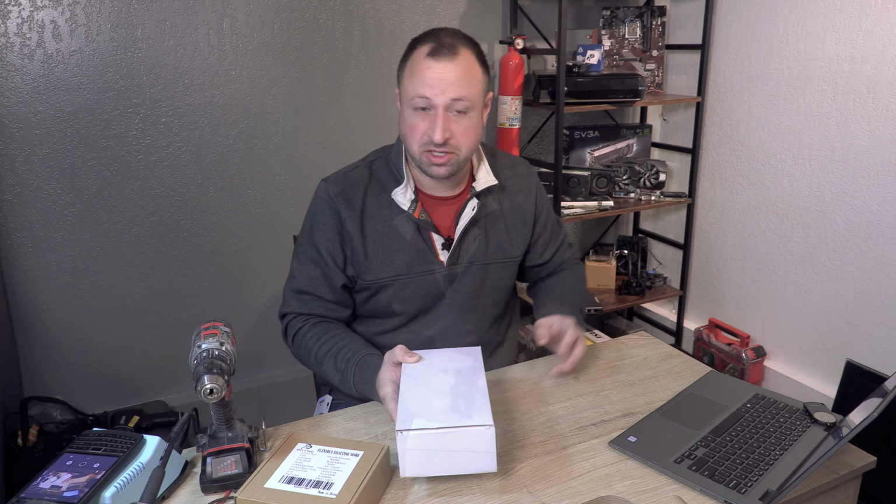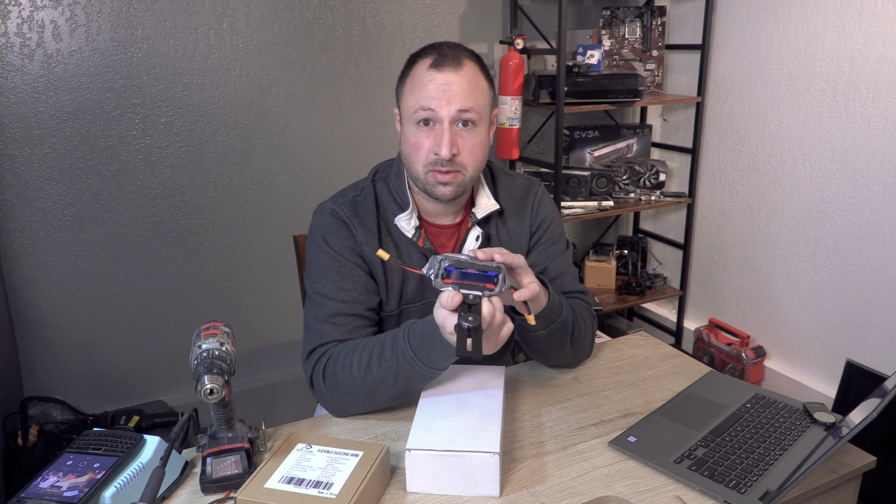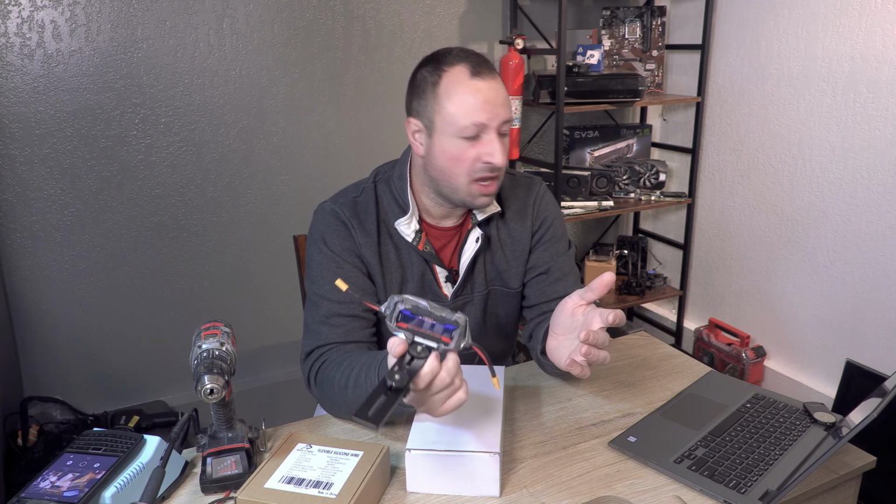What may help you understand what we're targeting here is a previous video that I did, which tested the wattage of a bunch of tools. So I used this little test rig here. This gave us some real-time current readouts so we could target what size of power supply we'd need. Based on those findings, the miter saw was the heaviest draw, and it came in at around 1200 watts peak and around 800 watts continuous. So we knew that we needed something that was at least 1200 watts.